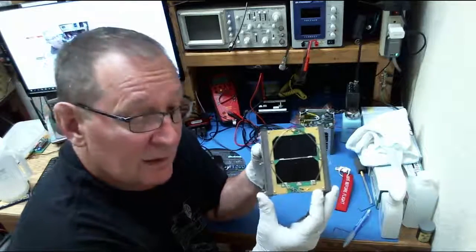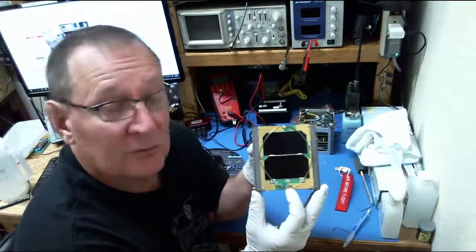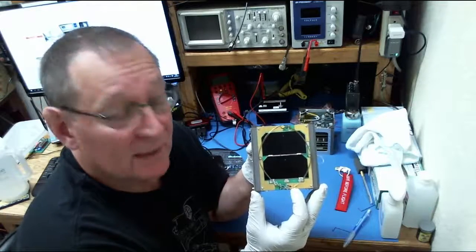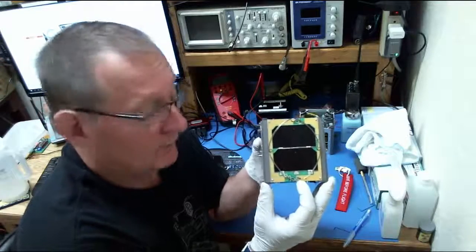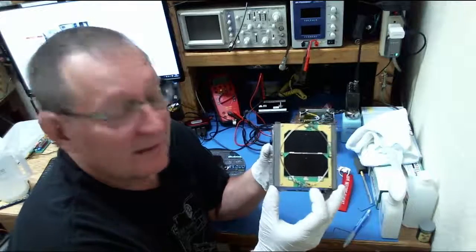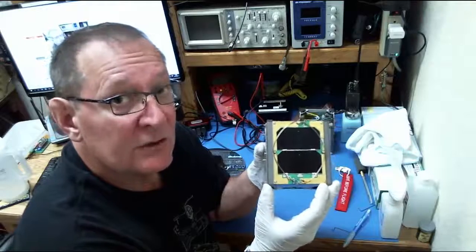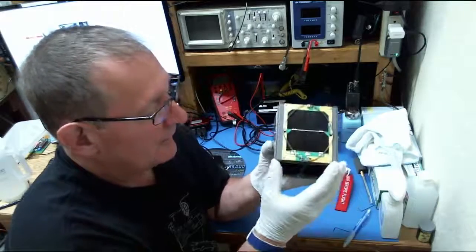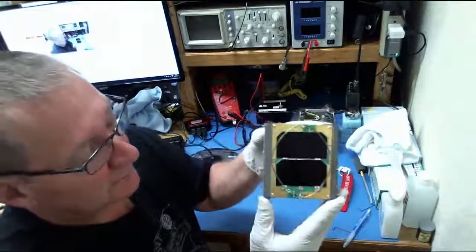When the time comes, we apply the direct battery voltage to this resistor, and the current runs about 1.5 amps, depending on the voltage. That resistor gets pretty hot pretty quick, melts right through the fishing line. And as soon as it does, that lets go of the antenna. The antenna is made of nitinol wire, so it's going to want to spring back to its original shape, which was straight, and it will extend itself right down toward the camera here